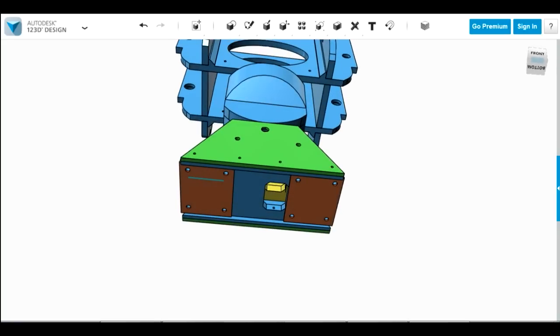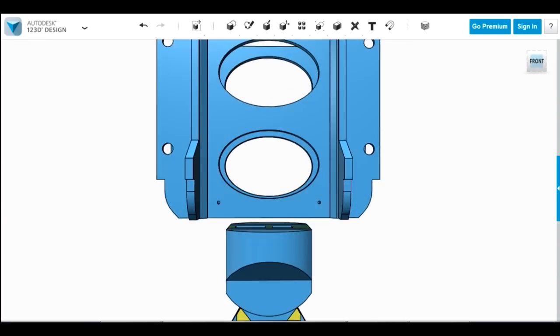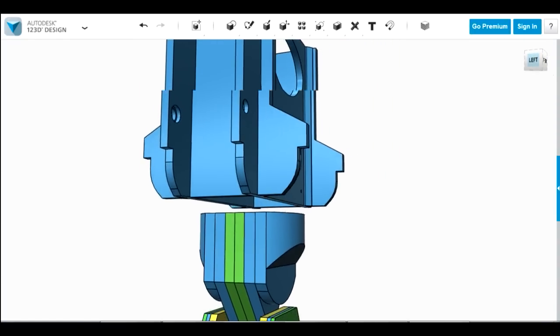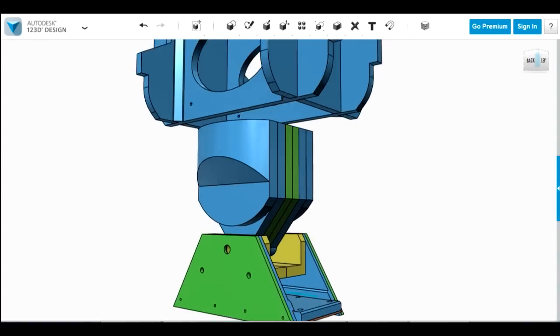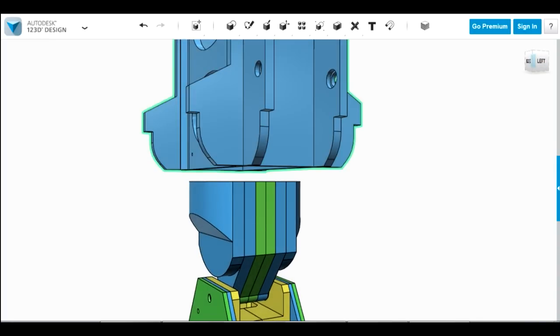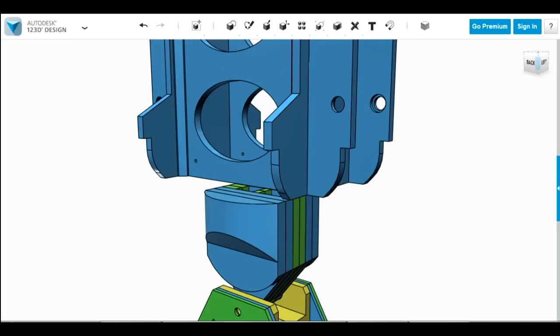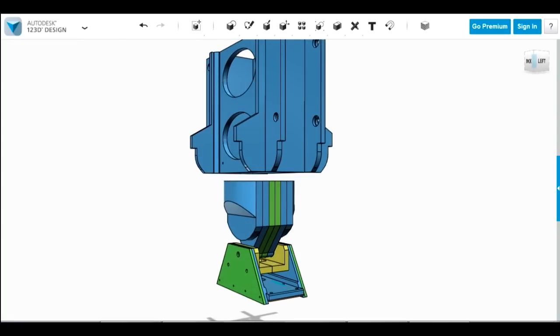And the caster spacing there means the casters can both rotate to the middle and the outside, and it still fits in with the size of the centre foot. So I've got the carriage here just placed here, which is of course where it's going to attach to, and I need to get that height exactly right. I haven't designed the coupling yet, and I'm going to print the foot that holds the casters, then print the leg, and at that point I'll be able to measure exactly how long it needs to be to get to the carriage and what the bracket looks like that mounts it, so that when that carriage is fully extended, the centre foot touches the ground at the same height as the other feet.